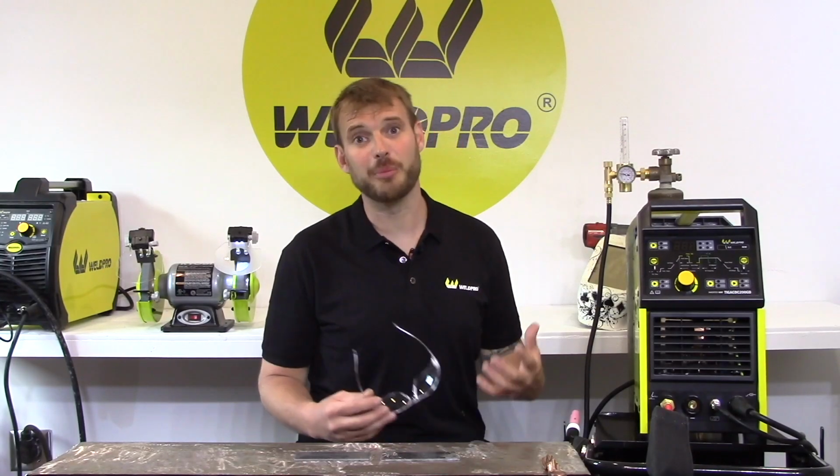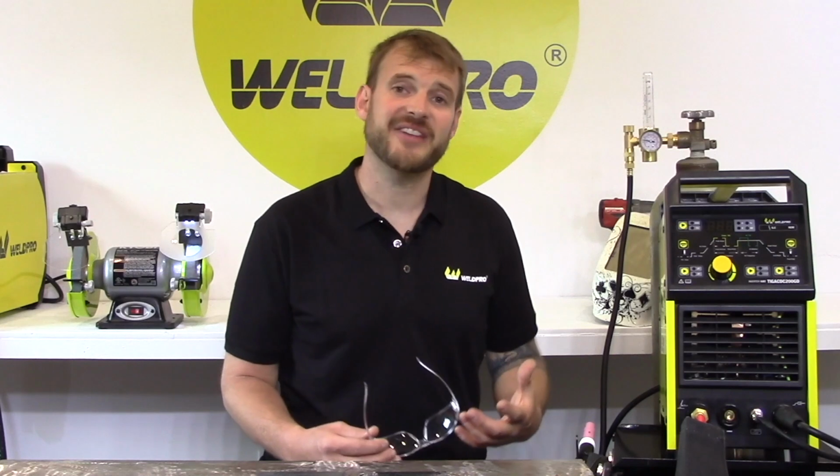The next step in the process is to turn on our shielding gas and to set our flow meter accordingly. I prefer to wear safety glasses when I open high pressure tanks. I do this because I've had some encounters with older flow meters and regulators that upon cracking that high pressure tank will actually fail and can explode.